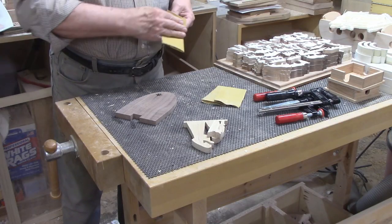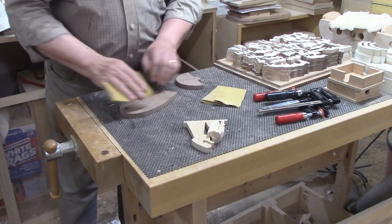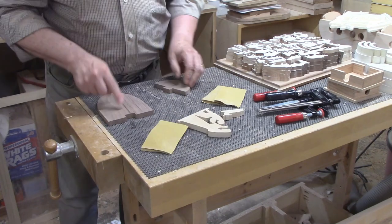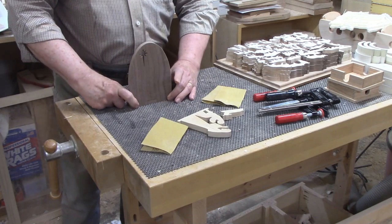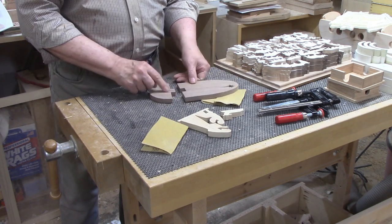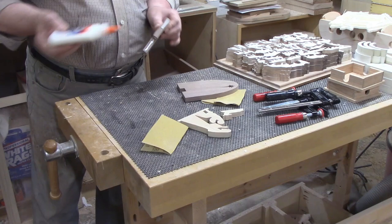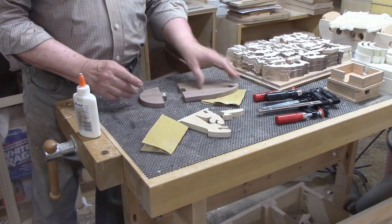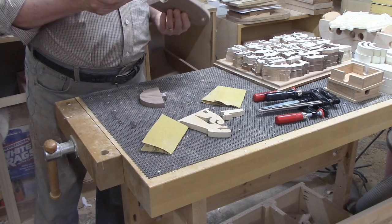With all the pieces cut, it's time for the glue up, but first I wanted to take the sharpness off the edges. I didn't need to round them over enough to need the router table — just soften them a little. A quarter sheet of 120 grit sandpaper does the job nicely by hand. Before applying glue, I did a quick test fit and the two pieces fit together with a friction fit, so I knew when I added glue they would fit together perfectly. I looked at the pieces to remind myself where to add the glue, then squeezed a drop onto the top of the tab, the sides, and the two surfaces that would mate with the back piece. For the back piece, I added glue to the slot and along the bottom edges, then slid the pieces together and added an F clamp to pull them tightly together.